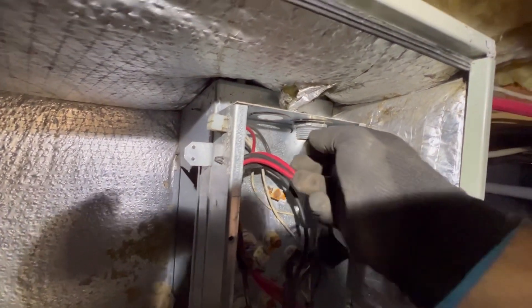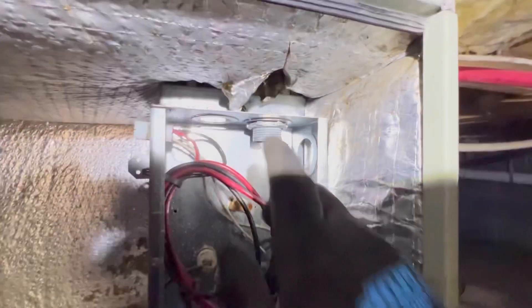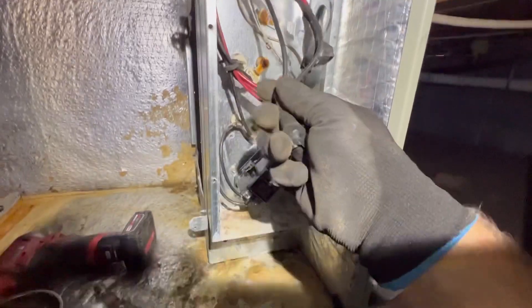You'll wire the high voltage — this one's too short, but usually the electrician does that. He'll wire the high voltage either over the top down through here into this electrical connector, or through the front of the air handler, where it'll mate with these reds and these blacks, which are both legs of power.